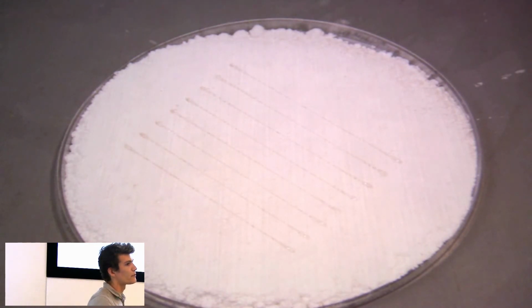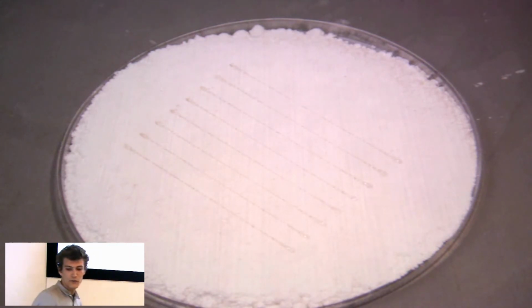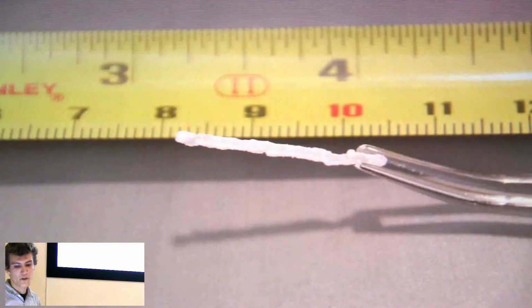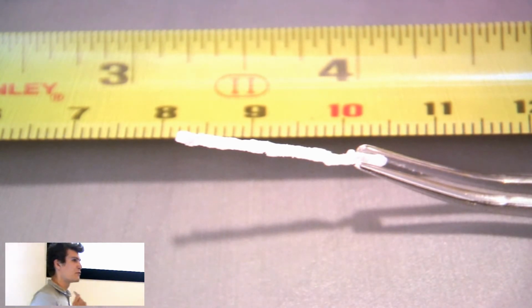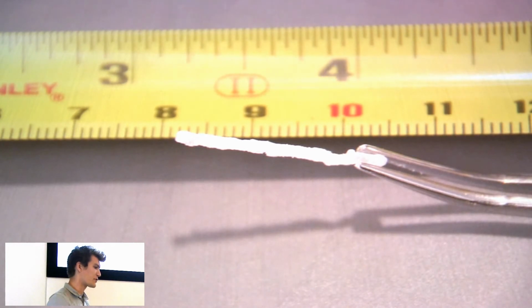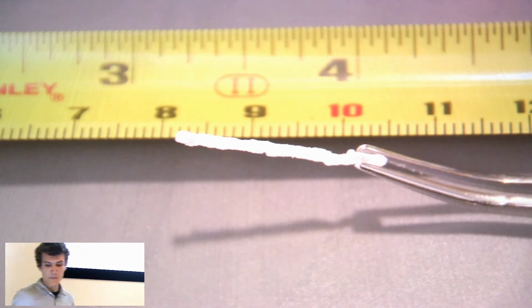So we're starting very simple, to just establish the very basic parameters for sintering. So this is just a speed and power traversal. Each line has a different speed. And so we're starting to get close to sintering parameters. We're getting sintered regions on the millimeter scale, which is promising. So once we can do 1D, it's a short step to 2D, and once we do 2D, it's another short step to 3D.